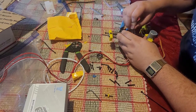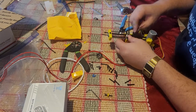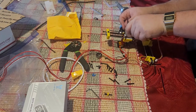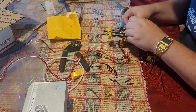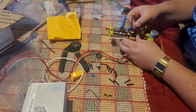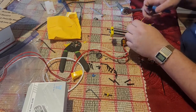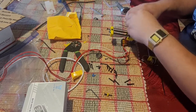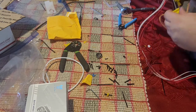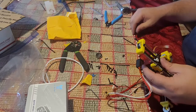Tighten this up a little bit more. Get that tight, but not like super Voron tight. I like taking this zip tie here and feeding in at a diagonal around that zip tie so that we can get a little bit better tension on that. So that shouldn't, yep, that's good. That should move with the belt, that shouldn't have any slack in the belt. So there you go, there's that. So there's this gantry all done. Again, we adjust this by adjusting this here, the Y end stop.